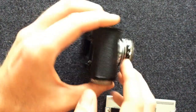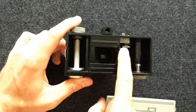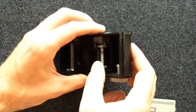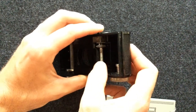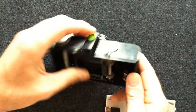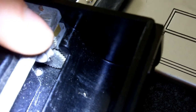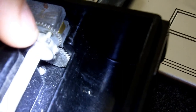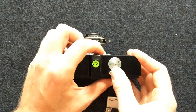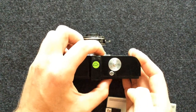Disregard that I'm missing a screw there. These cameras were not expensive cameras, and if there's something wrong with them, they're probably relatively easy to fix. One thing you're definitely going to have to do is lubricate your sprockets here. This releases the advance mechanism and you can rotate the sprocket forward. This piece of metal on top is caught by a brass keeper. This gear on top corresponds with the gear behind that's connected to the frame counter. If you release the sprocket and advance the film, your frame counter should move — right now it's on 14, I take my exposure, it should go to 15, and it does.